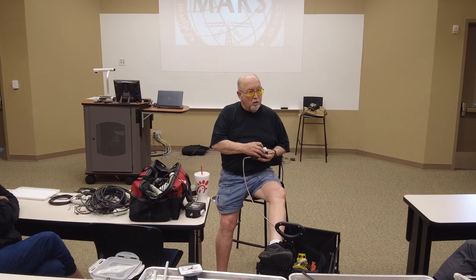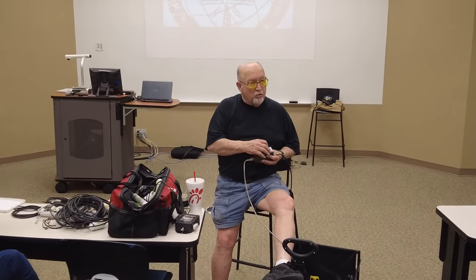If the SWR goes up, which it should, then you go down to the lower edge of the band, and if the SWR goes down, then it's too long, so you cut a little bit off and do the same thing again until the SWR is about even. Now, you're not going to probably ever get a 1-to-1, okay? On HF, if it's under 2, it's fine.